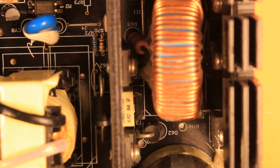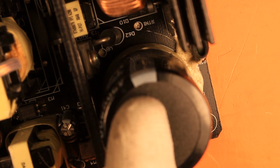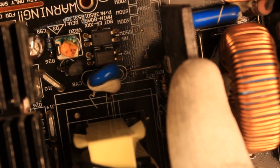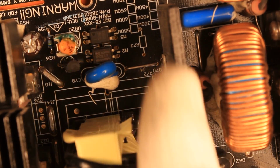The chopper transformer is then having this roughly plus 310 up to 330 volt DC being chopped through it via these two field effect transistors here, which are working in a push-pull configuration. And I don't know how well you can see it, but this is just a flat aluminum, there is absolutely no surface area like here for the active power factor correction. At least there is some cooling area to it. I mean, this is really a poor quality job. I'd say that these field effect transistors are probably red hot when this thing is running.